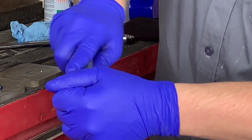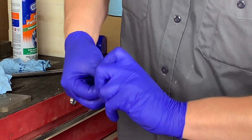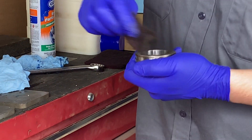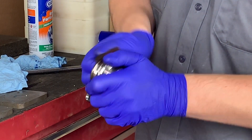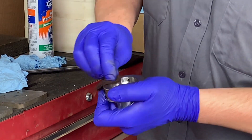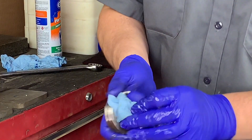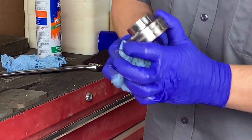And just like the cylinder, we're going to use some shop towels with brake cleaner and go ahead and clean all of those surfaces that we cleaned up with the Scotch-Brite, again making sure that all the loose debris has been removed. Moving on to the next piece — this is the seal housing, the part that contains the bronze backup and the rod seal. Again using Scotch-Brite, go ahead and clean up as much of the surfaces as you can, then take clean cloths with a little brake cleaner and make sure we get the part nice and clean.